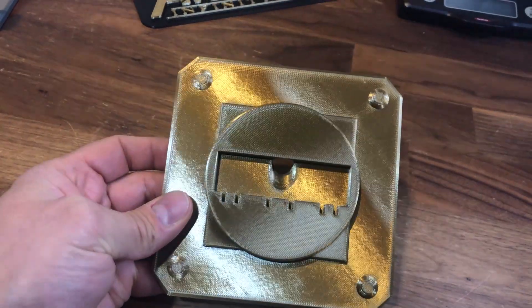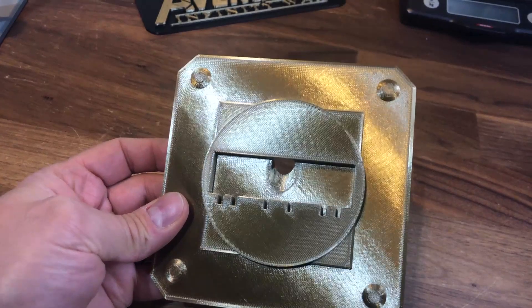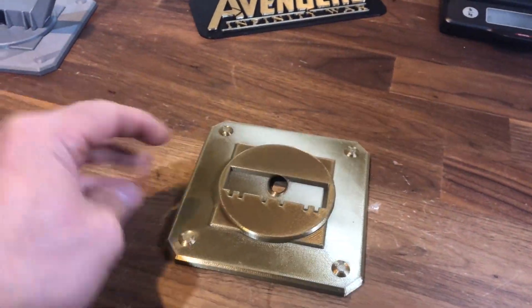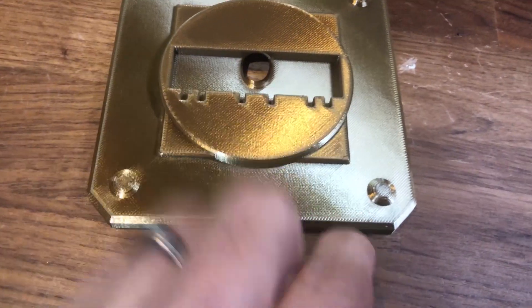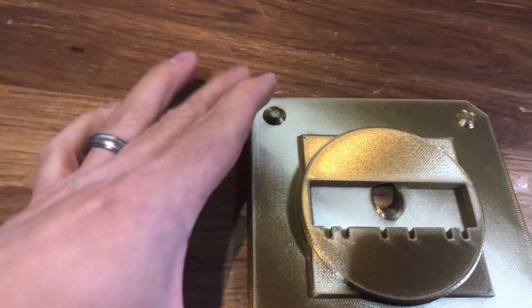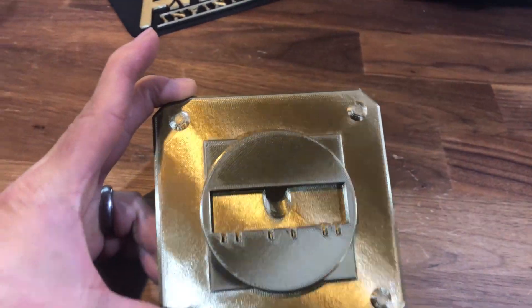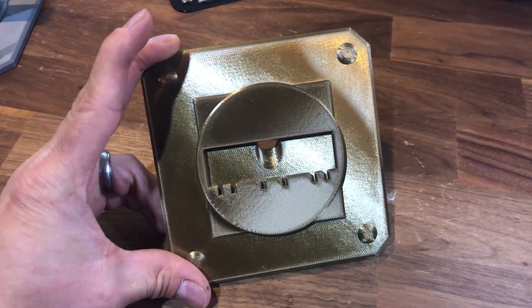Check this out — this is monotonic. The only thing that's changed is the top layer infill. Look at how even it is now. It starts at one side and just keeps going across, pushing forward to make that even distribution across the whole print. It's just a big difference.